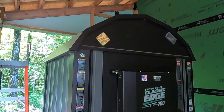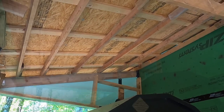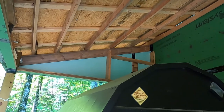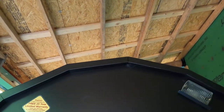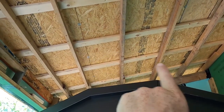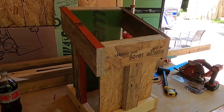While Robert's been doing that, I've been working on the boiler, specifically the chimney. We need a chimney box that allows us to get down below the ceiling level and also out through the roof and onto the top sheathing. Unfortunately, the straight shot up will go through one of the purlins, so we're going to have to cut the purlins and then bridge across. That bridging will support our chimney box.